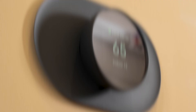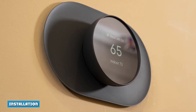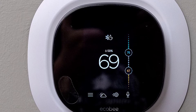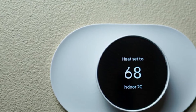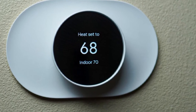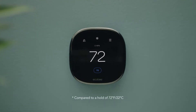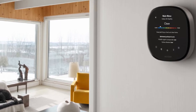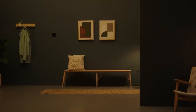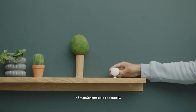Installation: if you're replacing an old thermostat, installing either Nest or Ecobee, you are likely to need at least a Phillips head screwdriver for the wall screws and a small flat screwdriver for the lead wires on your old thermostat. It may also be handy to have a drill, pencil, wire stripper, and small pliers for straightening old leads. There are basically two common kinds of installation: with or without a C wire. A C wire offers a constant 24-volt power supply. Don't worry if you don't have one — both thermostats offer a workaround, although it may add steps to the installation. We find the Ecobee's written instructions simpler than Nest's, but both also offer video instructions and a tech help line to see you through.